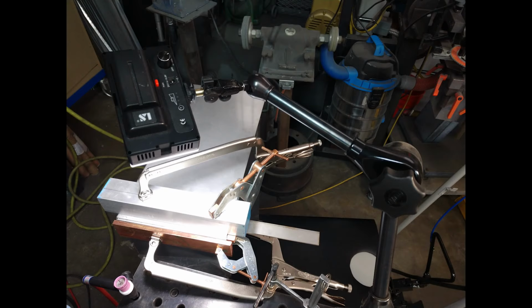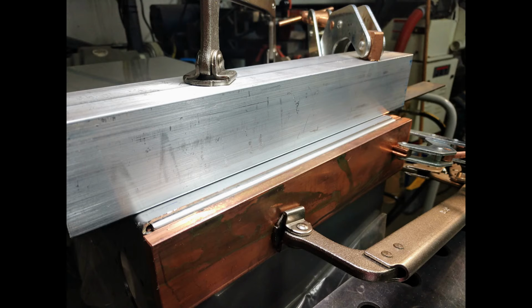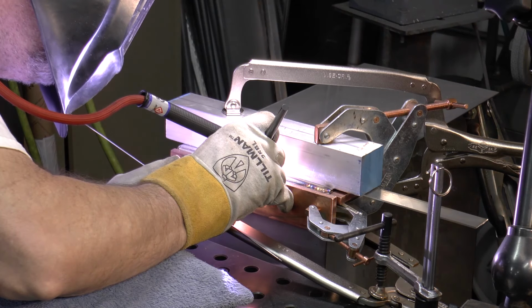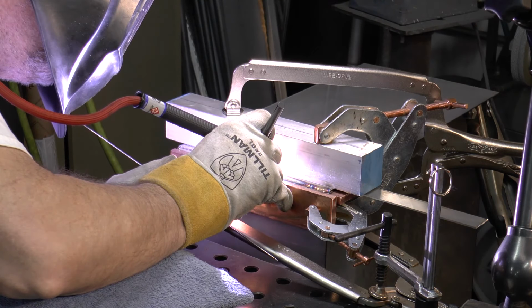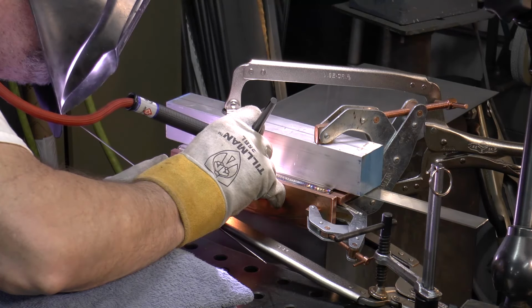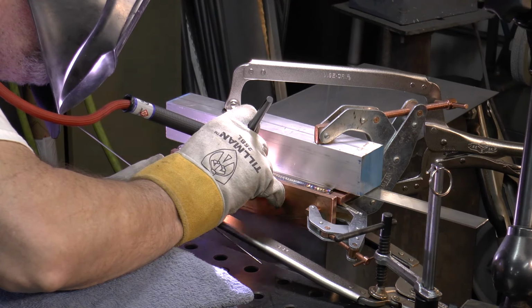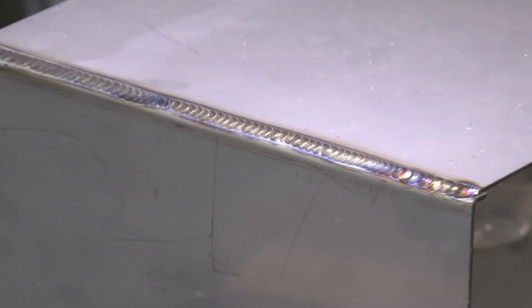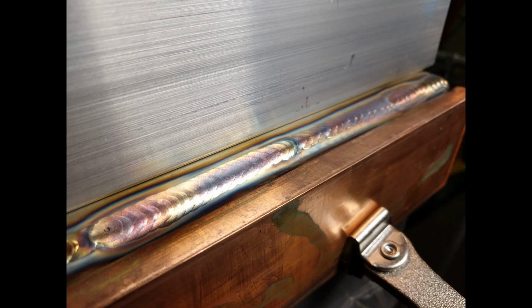You can see these sink plates that I have fastened to the stainless. This is a trick I use, angling. Instead of having a straight butt joint in a corner, I put an angle on the sheet metal, and it just makes the joint come out so much cleaner. You can see me using a pulse. It's a 1 second pulse. For all the stainless work, I really like using that 1-second pulse. It keeps a lot of the heat from getting into the sheet.